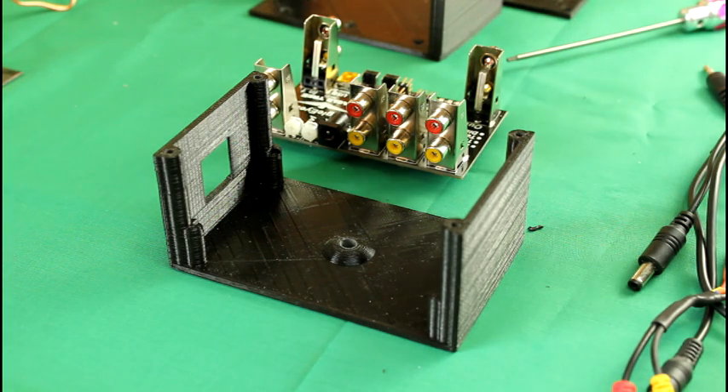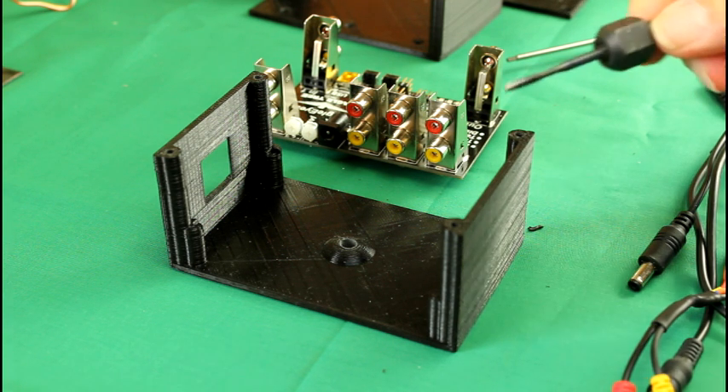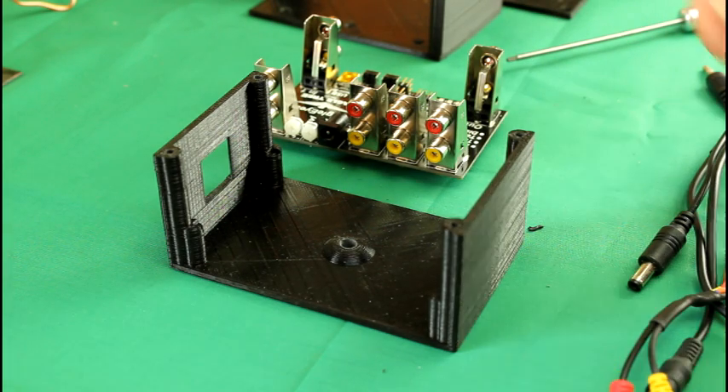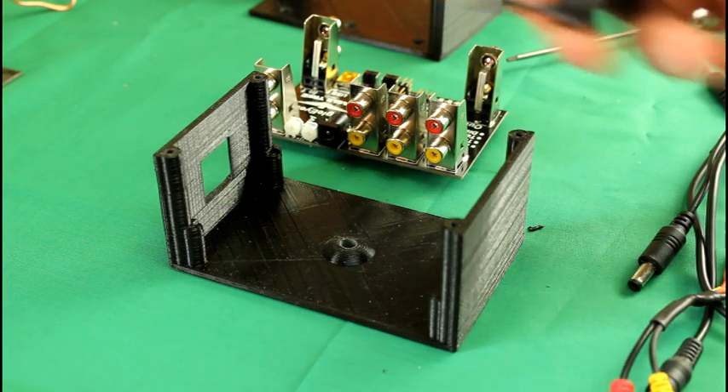We start by taking the first tier and the Eagle Eyes ground station. These four holes — and indeed the other holes in the other 3D printed parts — are printed at 2.8mm diameter so that you can tap them out and thread them to a 3mm thread. You can get a tap and tap out all four of those holes to 3mm. If you don't have a tap, you can use self-tapping screws instead.